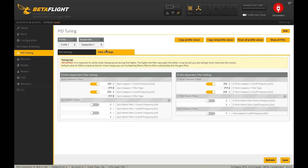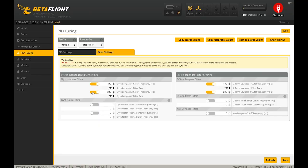In Filter settings, the new defaults on the latest version of Betaflight are great. The main reason I wanted to open it up is that you might want to reduce filtering or even turn off the second-stage low-pass filter on the gyro. On our Riot Control board, we designed in a soft-mounted gyro, and the board itself is soft-mounted, so there's a lot of vibration filtering built into the hardware. Typically when using a Riot Control, I can get away with turning off the second-stage gyro low-pass filter, but I'll keep an eye on motor temps the first time I fly it.